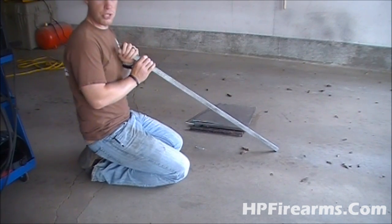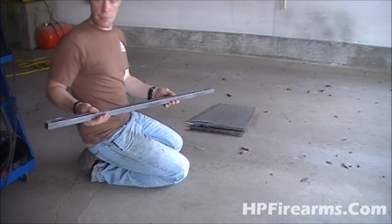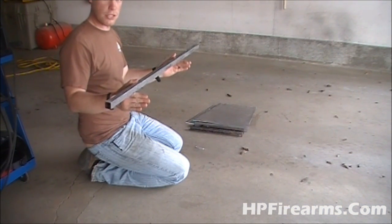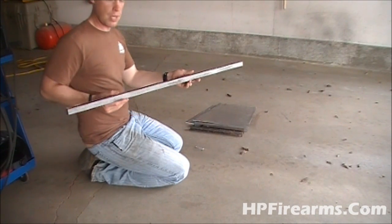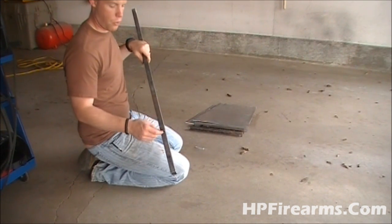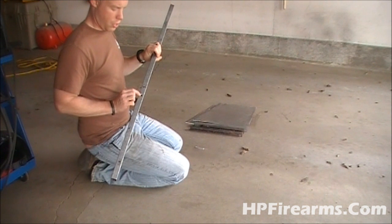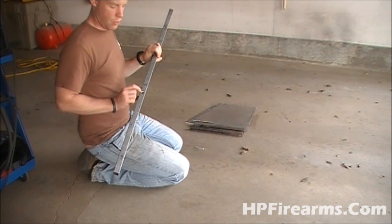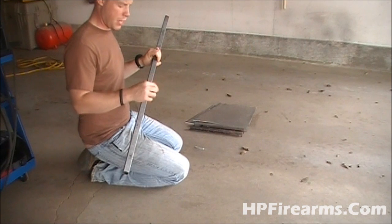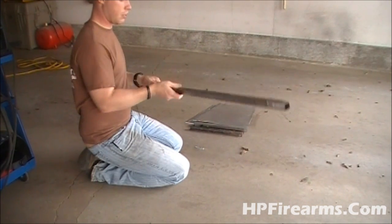I'm using a one-inch piece of steel tubing, cut 46 inches long. This is actually going to sit on top of that piece of flat quarter-inch thick steel we've already mounted to our pivot tube. I've drilled a hole up here in the front for our wires off the generator to run down inside, and there's a hole back here as well that will line up in the center of our spindle for the wire to come out and run down to the battery box.